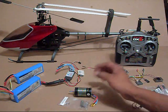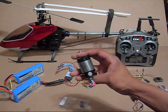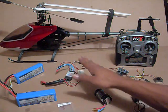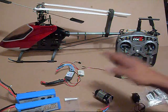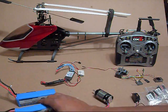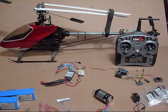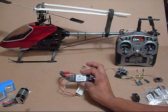For the motor, I've got a T-Rex 500 motor — a 1600KV motor — and I'm going to run mine on a 15-tooth pinion initially, set up with a 5-cell battery. I am going to go up to a 16-tooth pinion so I can drop down to a 4-cell battery. Since this is going in a scale Apache fuselage, I don't need extreme power, and 4-cell batteries are cheaper. I can also share them with my other planes. That's why I'm going with that, but when I do I'll need to switch to a 16-tooth pinion.